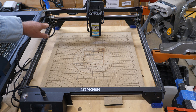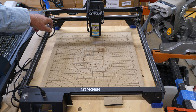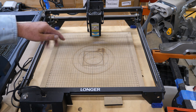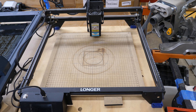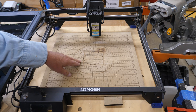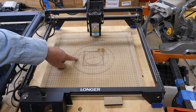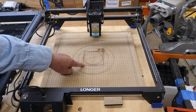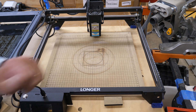If you have your eccentric set too tight and the machine sits for a long time, you'll end up with a flat spot on your rollers, and as the gantry moves it'll bump and mess up your project. Otherwise, just keep things clean. I also have some layouts in here — there are a couple of oopsies from over the years — for laying out square items, round items. When we do large cork bases and trivets, that's what the outer circles are for. This one is for four and a quarter inch tiles if I'm doing a single one, and if I'm doing a batch I have a template to run them.